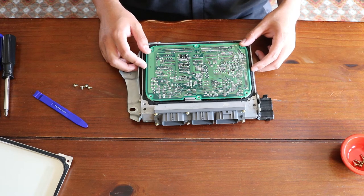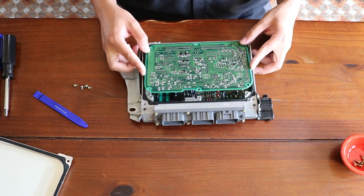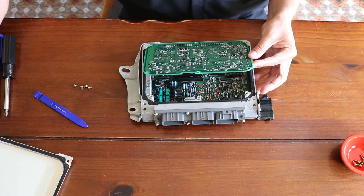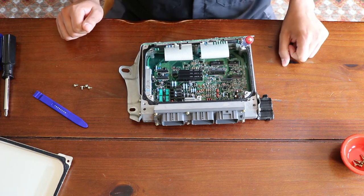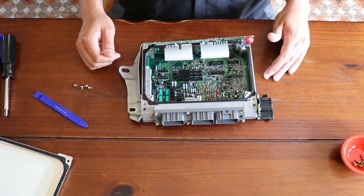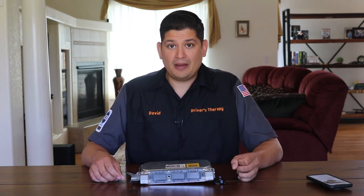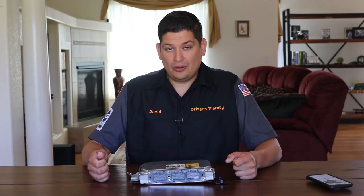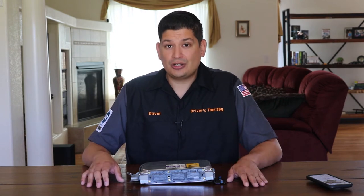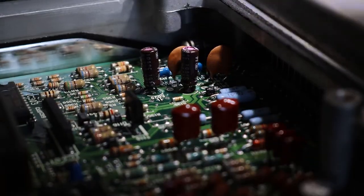Pull up on the circuit board very carefully and slowly, because below it there are some ribbons you don't want to damage. I saw in another video where someone stuck a screwdriver in to hold it open, which worked nicely. Once it's open, look at the board and find the capacitors — they're brown. You're looking for anything that looks like rust around the base of their legs where they connect, or something like brown or clearish murky glue-looking stuff at the bottom, which means the capacitor is leaking. Look at all the brown caps, and if unsure, post pictures on the forums.